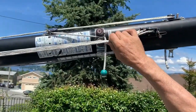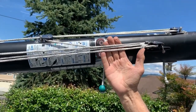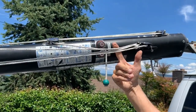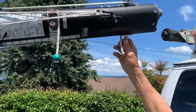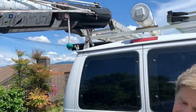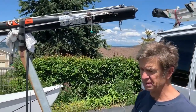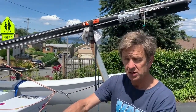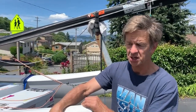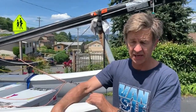They went with a three-to-one jib halyard — this shackle hooks into the jib and it's a great system. If yours doesn't have it you'll want to change it out, but there's about 70 feet of spectra involved so that's not cheap. They also recently added a five-to-one downhaul where the boom comes down to the mast. You don't really need that just for cruising, but if you're getting into racing it's definitely a must-have. My biggest advice overall: identify a piece of crap when it's a piece of crap, don't try to force the situation, be patient, wait for a better boat, and hopefully you'll find a good one. Thanks for watching.